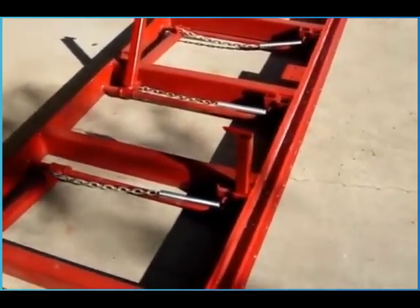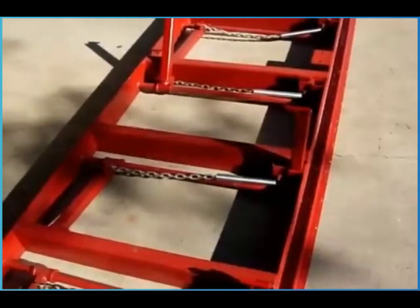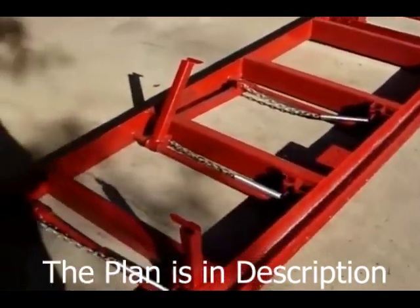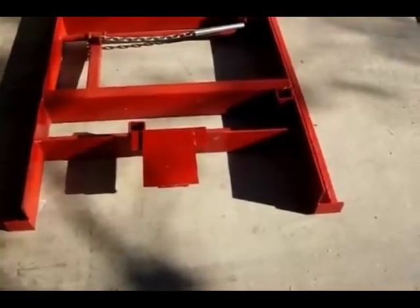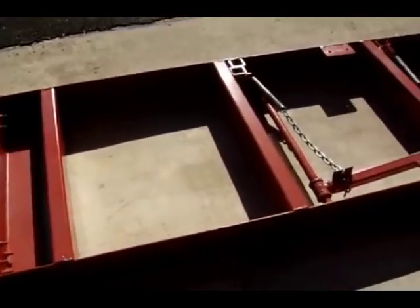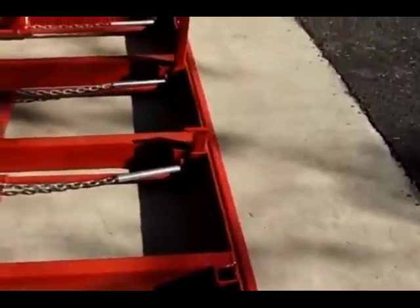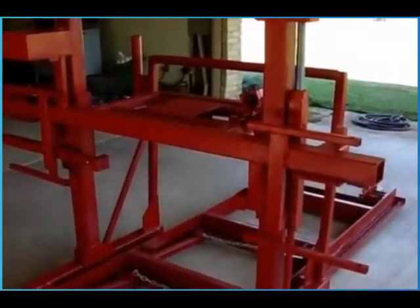The saw itself has wood covers for the blade. I did that because if a blade ever breaks — and I haven't experienced it — the thought is that maybe the blade will hit wood and might be salvageable. It uses B belts on the pulleys. On the drive side I have the big 20-inch pulley, and then a smaller pulley that runs off of it and shares the B belt with the blade. That goes through and is hooked to a clutch — as you rev up the engine the clutch engages.